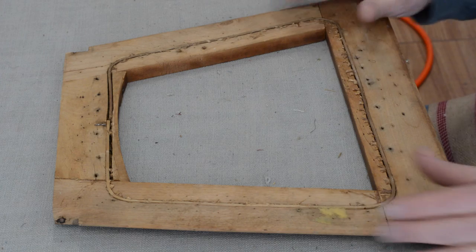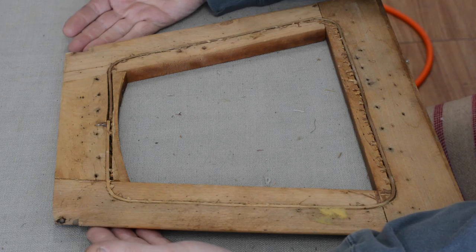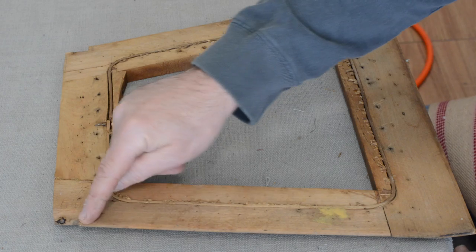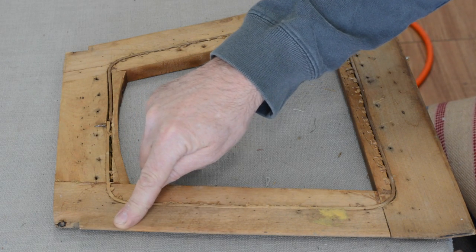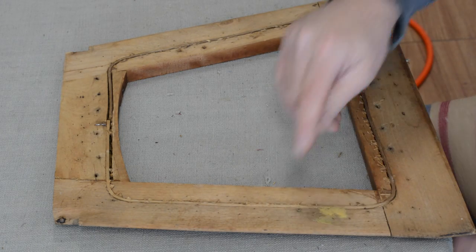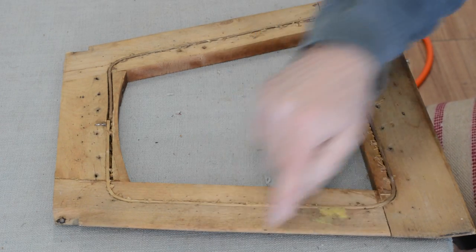Okay, so here we are with a beautiful frame to work on. What makes it beautiful is the woodwork has done its job here. This is a beveled frame, so it comes into the chair really nicely, really clean. That's what you're looking for in a slip seat, if you can. These are high-end chairs, you can tell, every time it's beveled like this. When it's put into the chair, the fabric seems to just disappear into the wood. It's what we call a good transition line.